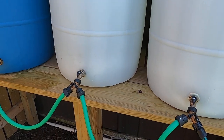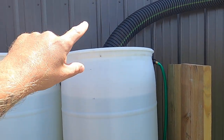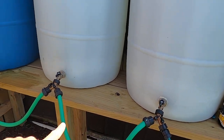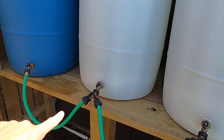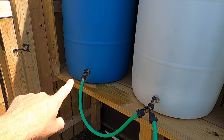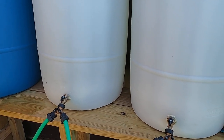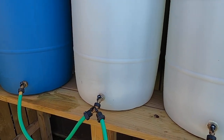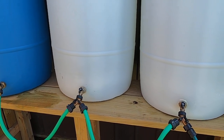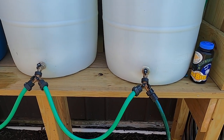From the ball valve we go down to a Y-splitter, which is really handy. We can open up all three barrels and draw from them all at the same time, or water can fill into just the first barrel and I can open just one or isolate one however I want. I've got another Y-splitter going to the third barrel. That configuration really helps a lot for managing water.